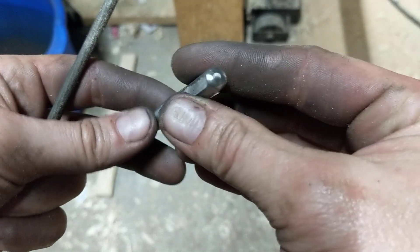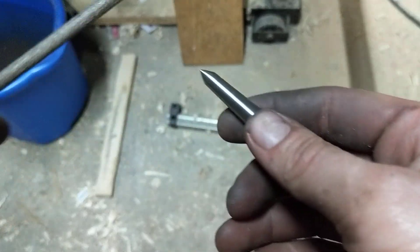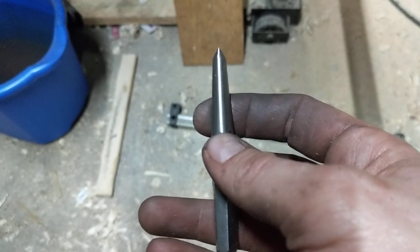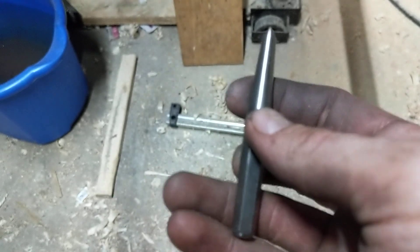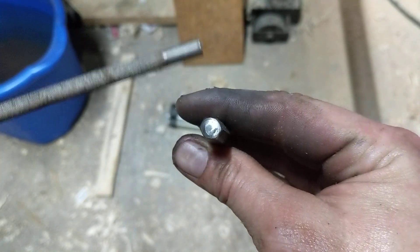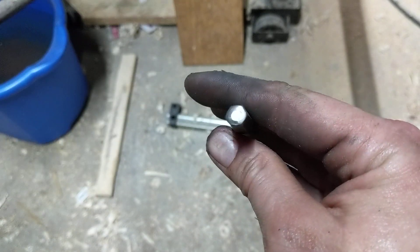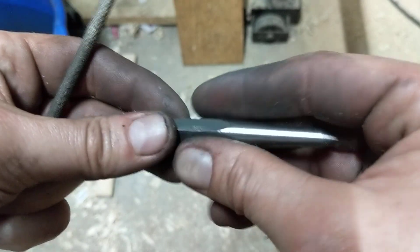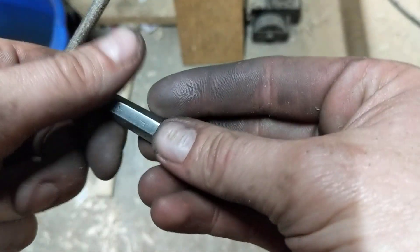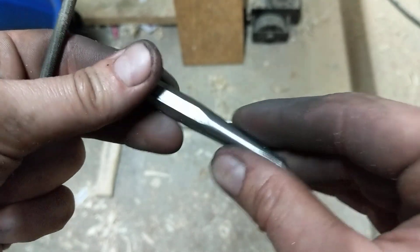A convenient part about having a forged hexagon: I recently acquired a machine lathe, and it came with two three-jaw chucks. You can't chuck up a square in a three-jaw chuck because the degree of separation between each jaw is 120 degrees, and a square is obviously 90 degrees. You can do multiples of 120, so our hexagon here has 60-degree sides, and we can chuck it up perfectly fine in a three-jaw chuck. In doing so, I was able to machine this — the first time in my life I ever forged a part and then machined it. I set the compound slide to match the taper and the results are just beautiful.